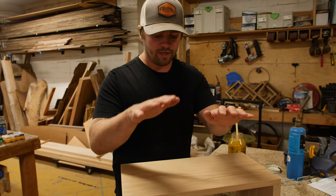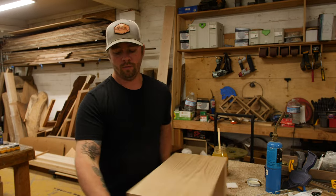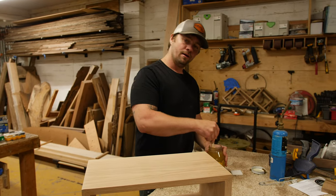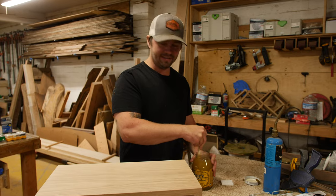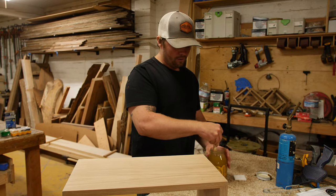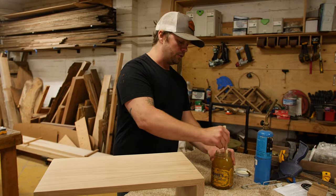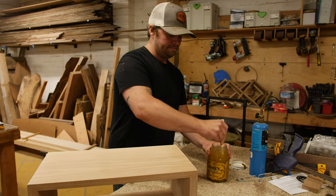The floating nightstand is done. We just sanded it to 220 grit, got all the edges pretty nice and tight. The inside's all sanded, we got our French cleat glued in to the top interior of the back. We got our Schooner Creek Designs brand right on the bottom left corner. This thing is ready for oil — of course we're using our favorite Odie's oil. Not sponsored by Odie's oil yet. For the oil, I always use two different oils that they offer. Right here I'm going to use the super penetrating oil. Make sure you mix it up super well. We use the white colored Scotch-Brite pads — technically the no grit. You can also use the black or gray one, which is the 300 to 500 grit Scotch-Brite.